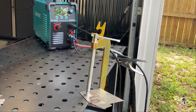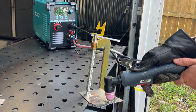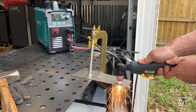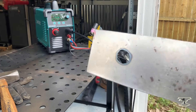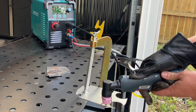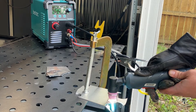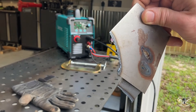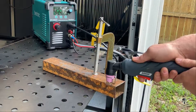We're starting off with mild steel sheet metal, running at 20 amps. We also punched a quick hole — that came in handy. Using the same settings, we cut a piece of sheet aluminum. That cut sheet metal has very little dross on it and should be pretty easy to clean up. Almost no slag buildup on that piece of aluminum. Now we're moving on to cut the rusty box steel tubing.